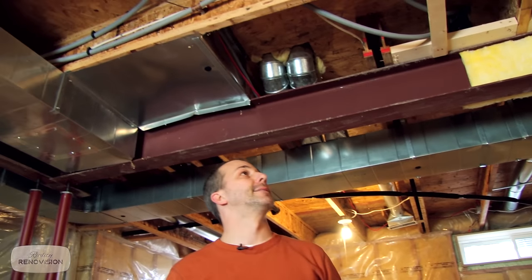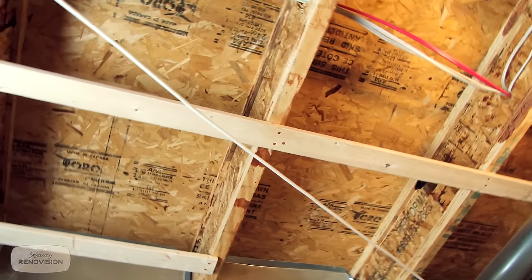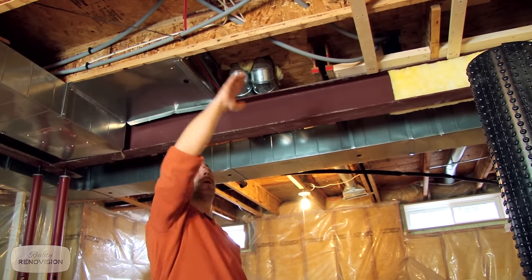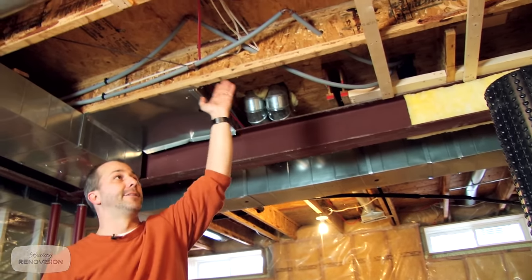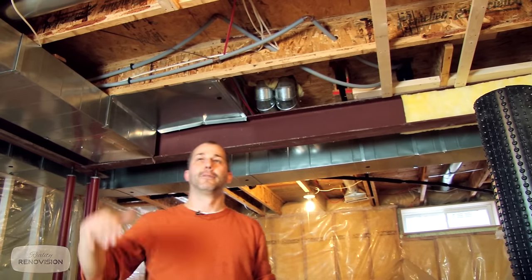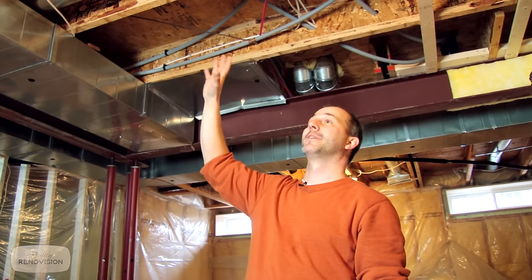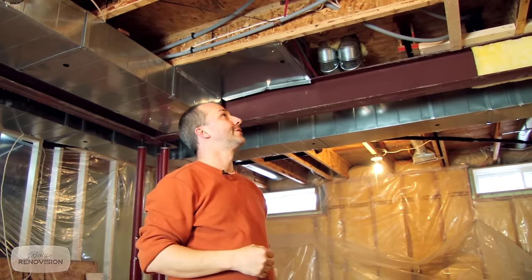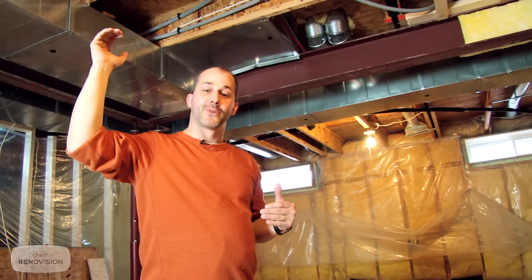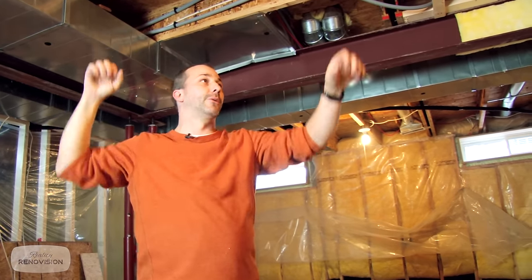This particular house has a typical construction — they have new engineered beams, basically laminated plywood layers. They're very strong, protect against deflection, and have extremely wide spacing — not 16 inches on center, more like around 22. So we're going to strap in the other direction, giving a channel for our electrician to run all his wires and also actually strengthening the floor above. Engineers tell us that putting strapping in the basement doubles the strength of the floor above by stretching out the load-bearing weight.